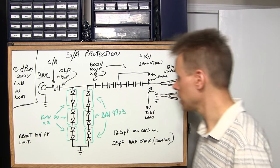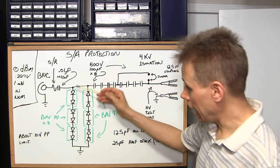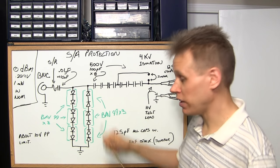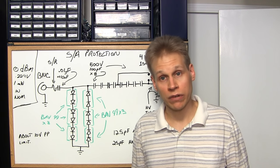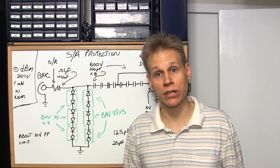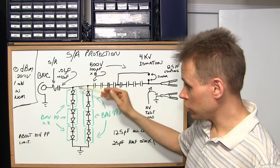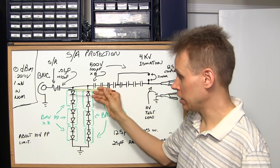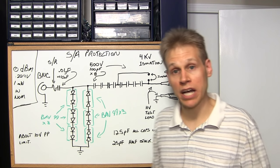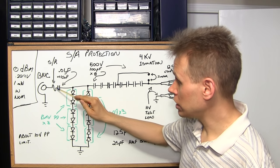If there is some form of arc-over in here, we have diodes on this side that will allow only a positive or negative 5 volts at this particular point — anything over 5 volts gets clamped down. That's a little extra protection. This is a limiting network so that only about 10 volts peak-to-peak can get through this whole system — it will start to clip at about 10 volts peak-to-peak. We also have another capacitor here as a little bit more protection right to the input of our spectrum analyzer.